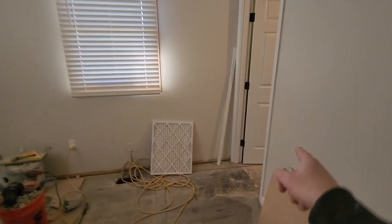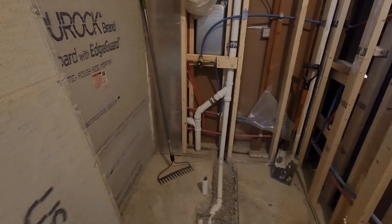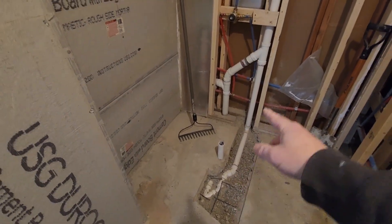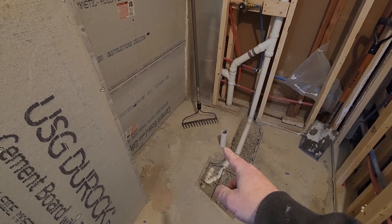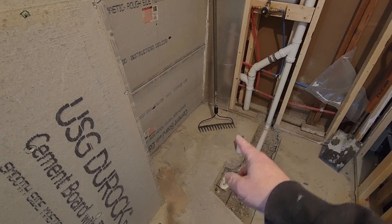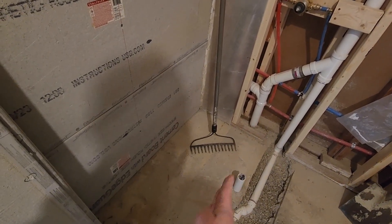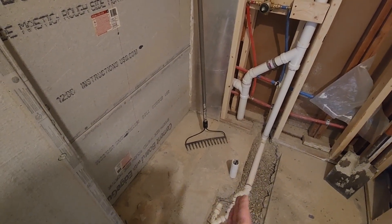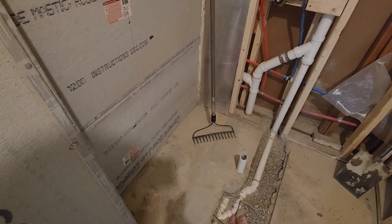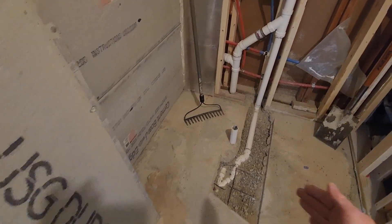These are the two cabinets that are going to go in this bathroom. But this is perhaps the biggest problem I had with the inspection. This pipe right here was not there originally — I had the pipe for the shower and this two-inch pipe on the side, those were originally there. But this vent pipe right here was not there, so I had to add it. I had to break up the concrete, dig out the gravel, and add that vent pipe.